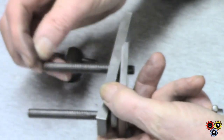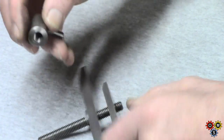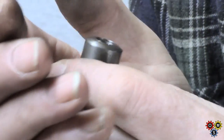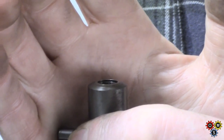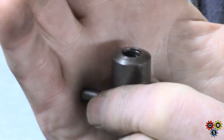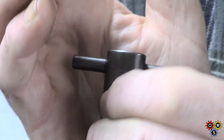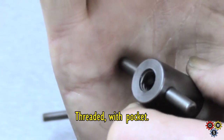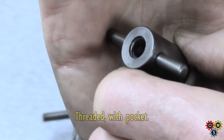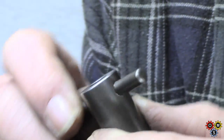and then finally with a washer, I'll put this little guy on. That also has a radius, because again that's bearing down on a top jaw which may not be horizontal. And the T-bar is actually two separate pieces. You might just see in the thread there the end of one of them. They're quite short, don't have to be very big.